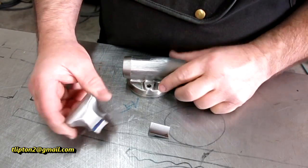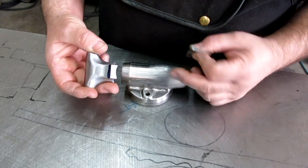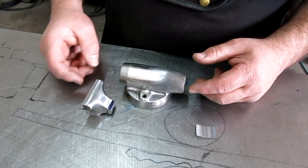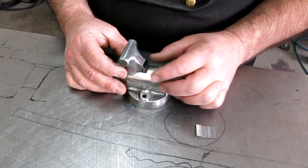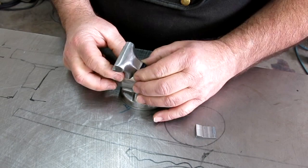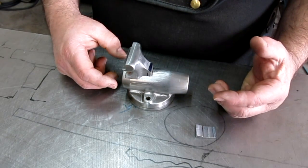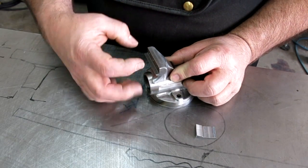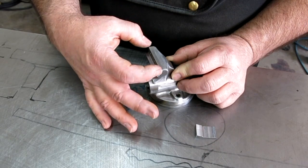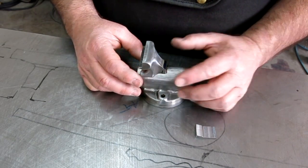We're ready to do some welding here. We're going to attach the jaw and the little anvil piece. I did some prep work off camera — I put some chamfers on that to make the weld go better and have a little bit of weld left after I sand it off. The key on this one is we really need to position this flat here for the vise jaw parallel with this base. The second jaw we'll register off the first one, so whatever errors — or perfection — creep in from the welding, we'll transfer that across.